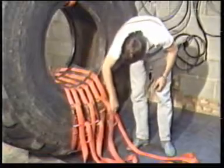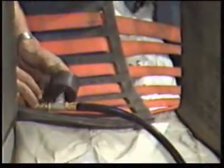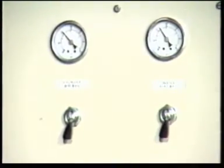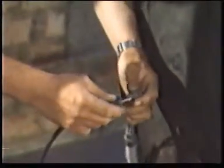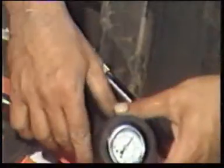With the airbag pressures having been preset, the air lines are then connected in the following sequence. First, inflate the cylinder bag up to 15 psi and then let the inflation continue. Then inflate the inside airbag to 15 psi, again letting the inflation continue. Lift or roll the tyre so that the outside airbag is not in contact with the floor. Then inflate the outside airbag. The power and thermocouple plugs are then connected to the inside and outside heat pads. Check the inside and outside airbag valves for position to make sure that they are not trapped. Then check the airbag pressure gauges.